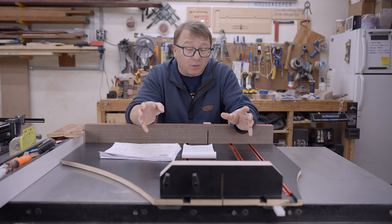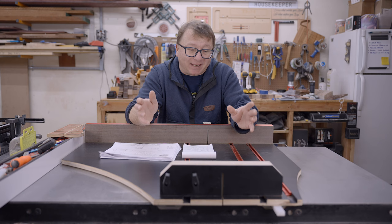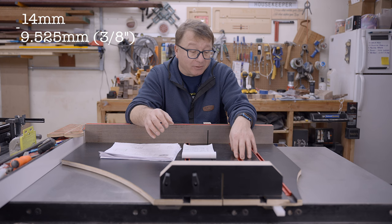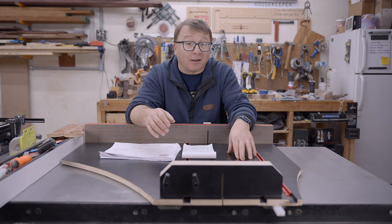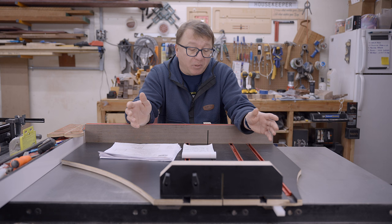I thought, no big deal — 14, 18, whatever it takes. Well, that is simply not the case. When you subtract a three-eighths-of-an-inch thickness from 14 millimeters of Baltic birch, you end up with a surface that is super thin and not thick enough to screw into. The T-track I needed to route into it — the wood was not thick enough to screw it down. I could have epoxied it, but epoxy doesn't hold T-track as firmly as you'd want. Screws and epoxy together are the better choice.